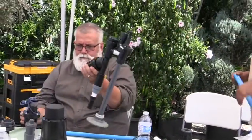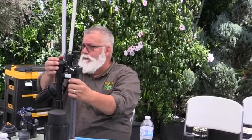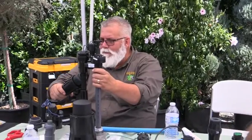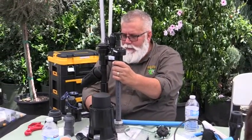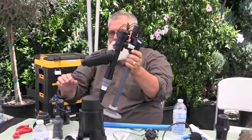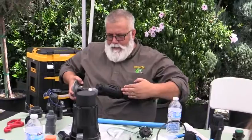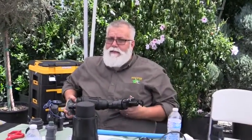When putting in a drip irrigation system, you normally have to use a big filter like this one. This is an anti-siphon valve with a miniature backflow right here, and it comes back down. You have your filter right here, your pressure regulator right here, then it goes back out to your drip. If you had this in a valve box with an inline valve, you have to have a jumbo valve box to fit all of this in.